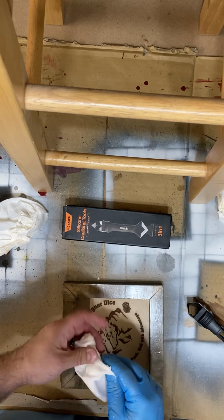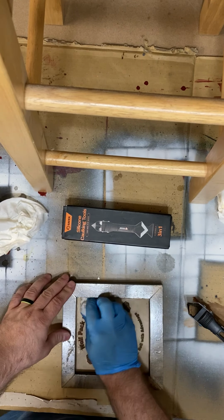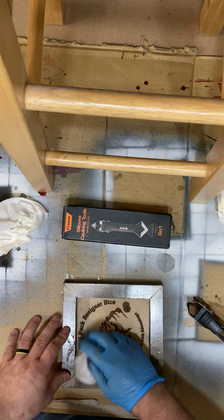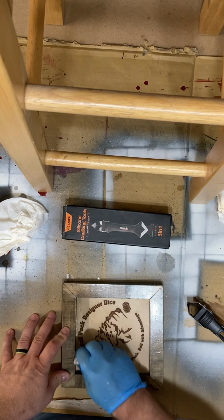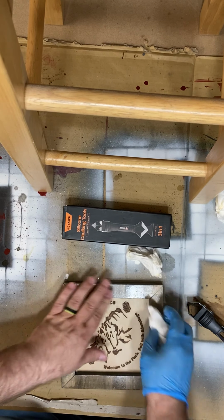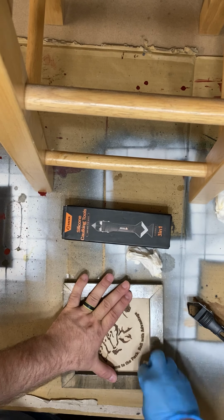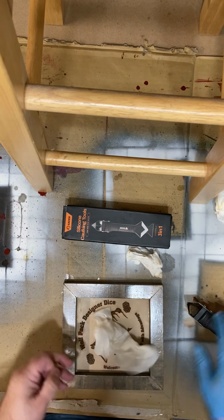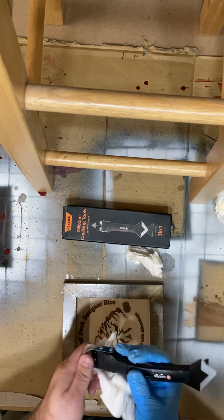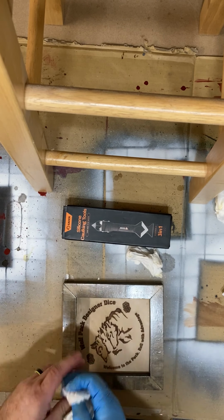So now I can take my handy dandy paper towel and wipe those inside corners and get all the glue off. And we'll toss some clamps on here just to make sure. Got a couple new towels because you want to make sure we get all the glue off of here. The 3 coats of polyurethane on here really help so the glue doesn't stick. And one more right here in this corner a little bit. And I know it seems like I'm being anal, but since we're going to be putting clear epoxy in here, I don't want anything in there.